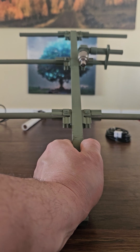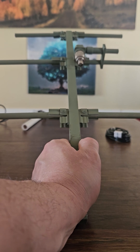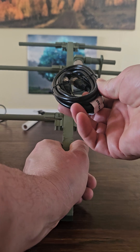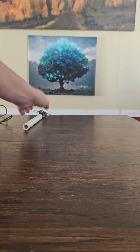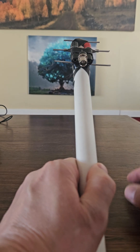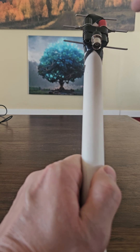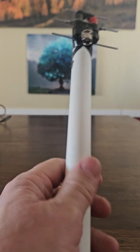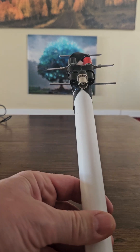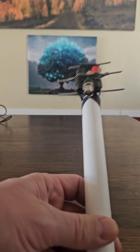You're really going to need both antennas — you're going to need a Yagi. This is a 70-centimeter Yagi, so in the FRS/GMRS range this works quite well. You could use it in the VHF range but having a VHF one will work better. With a Yagi you're going to need some coax to go to your radio. You can build a Yagi — I built this one for 2.4 GHz out of a dual-post BNC connector, 14-gauge electric fence wire, and half-inch PVC pipe. There's a calculator online that'll give you exact lengths so you don't even have to do any math. Cheap Yagis are easy to make.